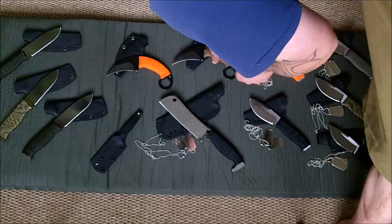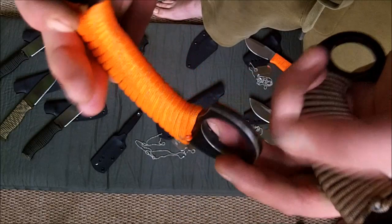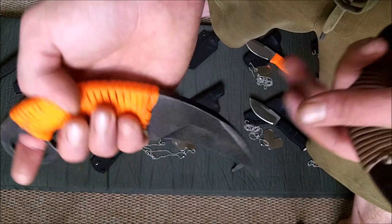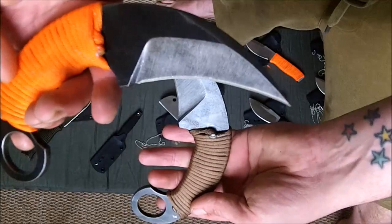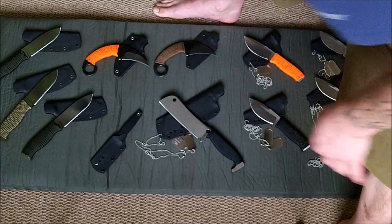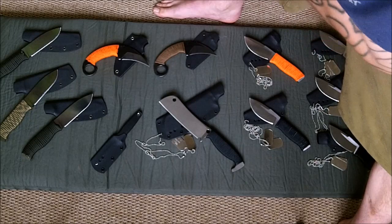These were made a little while ago. This is the last thing that I made on the glass pattern but I needed to tweak the edges a little bit. These have got a natural finish with a gun blue over the top — there's a grubby mark on that orange one, never mind. They're a good size, silly sharp, and again they're 52100 with the same heat treat process. About 5.8mm thick. There's one in brown paracord and one in high-vis orange with scotch light running through it. So they're going to be listed. I'm not asking silly amounts for them — they are just paracord wrap. At the minute I don't have a lot of G10 or Micarta, what I do have I put aside for customs, so I'm just using the materials I've got, which happens to be a lot of paracord.